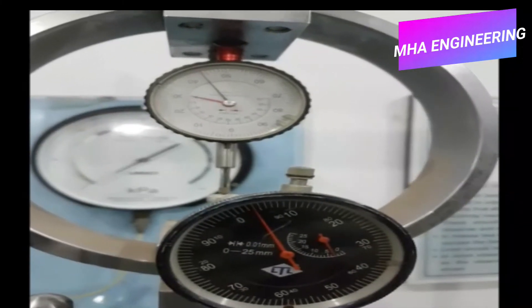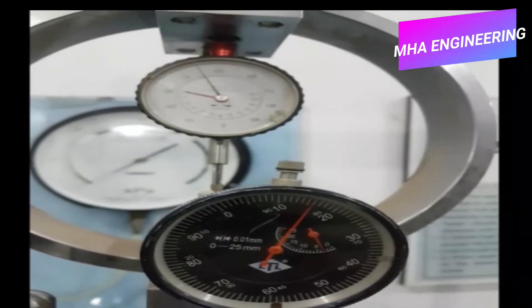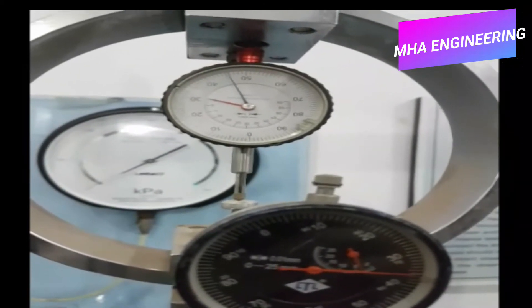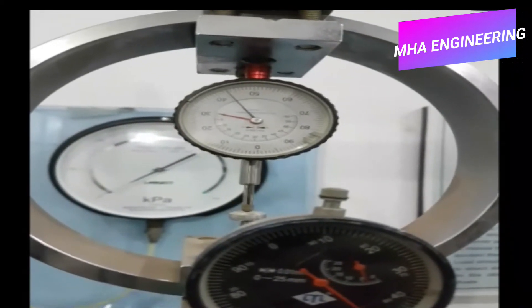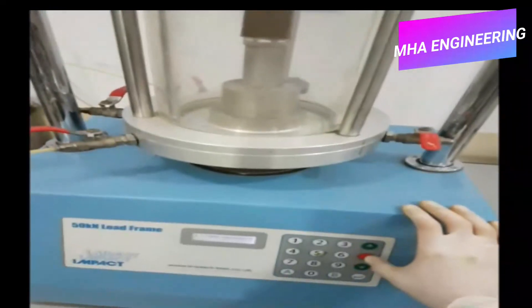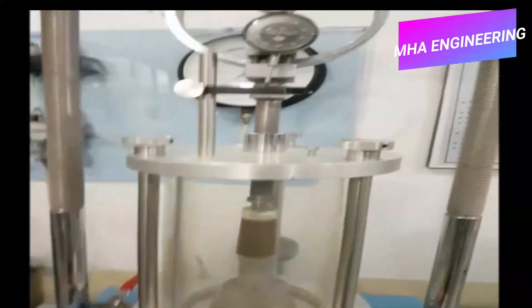As you can see, at 200 it is now 44, at 210 it's 45, going up to 45.5, then up to 46, and now it has started to come back. As you can see, the sample has also cracked — this crack coincided with the same time the deflection dial gauge started moving backwards. At that point you have to press this red button to stop the mechanism, and then this down button will bring it down.